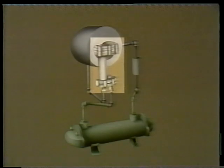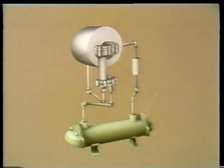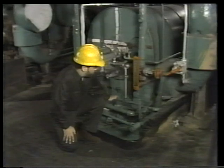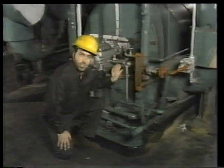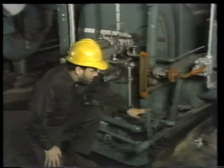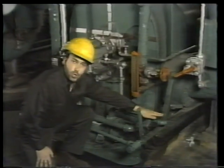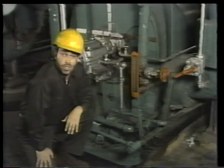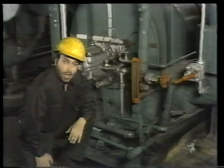The oil pump keeps lubricant constantly circulating through both bearings. Oil drains from both housings into an oil cooler — a heat exchanger that transfers the oil's heat to a flow of cool water. From the cooler, oil is pumped up into the side of the thrust bearing and sprayed directly on the thrust collar and the shoes. Another pipe leads into the bottom of the journal bearing housing, where the lubricant is picked up by the oil rings and carried up to the top of the bearing.